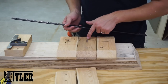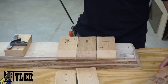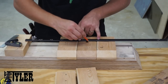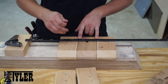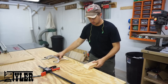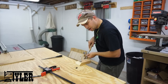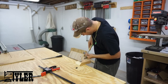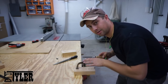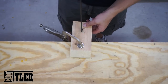To get the vise as stable as possible, you don't necessarily want a large hole — you want something snug that won't allow the bar to rotate when you have multiple 2x4s in place. So I'm going to use the bar itself to mark the width, and I already have the middle of the piece set up on the drill press table. I'm going to clean up that groove using a chisel. In the end you want a nice snug fit for your clamp — I think with a little wax that will slide along just great.